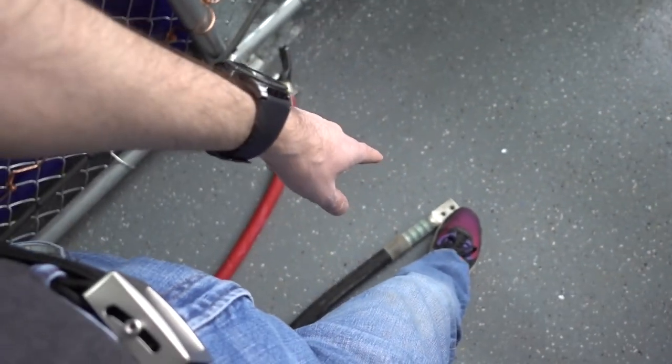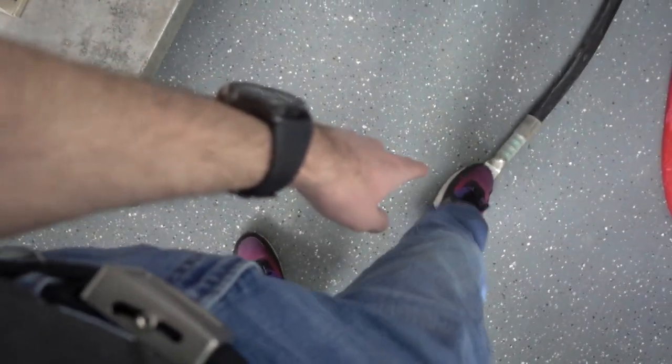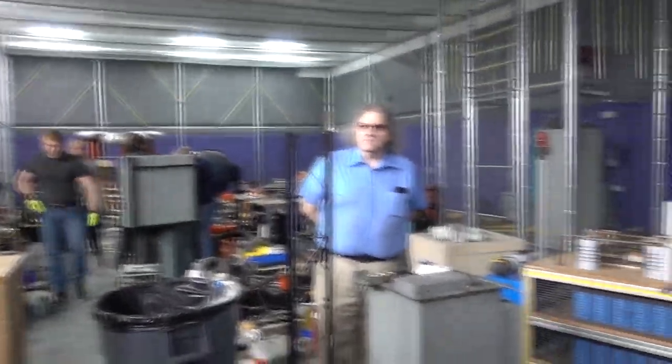What I'm thinking is, with the ends and the insulation, we'll do the PVC tube like we had before, because that's rated 2 kilovolts, but it's a metal box, so I want the thimble. We'll terminate, the end will have a thimble like that, and it'll just be a bolt-on right onto those. Very similar to the original system, just with much larger, softer, happier cable.